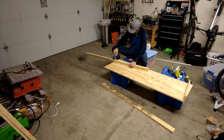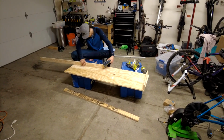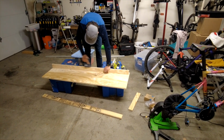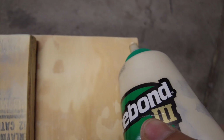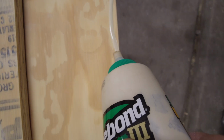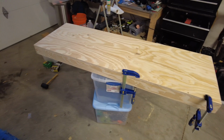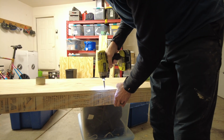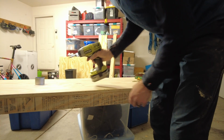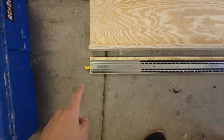Next up is sanding. This just may be the most time-intensive part of the whole project. Use coarse sandpaper to start, and then something finer until you are happy with the smoothness. Once you've sanded all the pieces, it's time to attach them together. One joint at a time, glue the pieces together and then clamp them in place. Use wood screws for an even stronger joint.